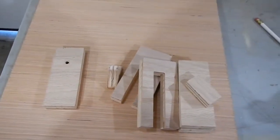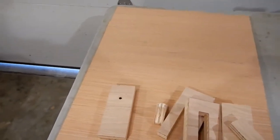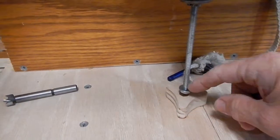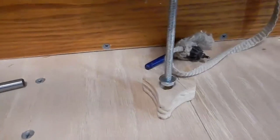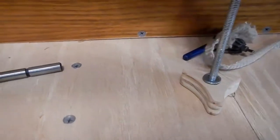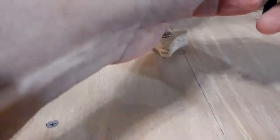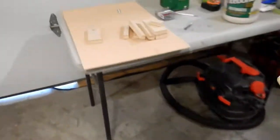That piece is sanded — ready to put them together. I think I'm going to use a little CA glue and a little Titebond Ultimate wood glue. I've got to push in the nuts and get them ready. We're going to press this nut in there — I've got a little bit different nut; this one has a retainer on the inside so it'll push on both sides. Line up the point of the nut with the point of that hole and just push it down in there. Then loosen this up. The pressure on this is pulling this way — got that nut in there. Let's go ahead and push the other one in. This one's basically just a carriage head with a nut on it, and what this does is push against the plywood — quarter-inch plywood — so that it doesn't mash or cut into it. This one will last a lot longer.